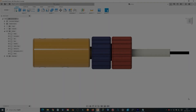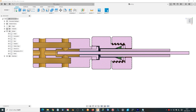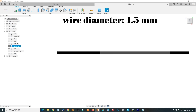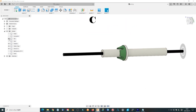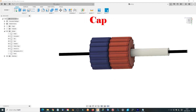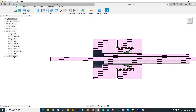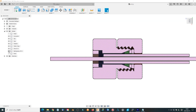The design idea and concept is the same as I described nine months ago. Use a flexible stainless steel wire to transfer the torque from the motor to the output head. Use a Teflon tube to fix the stainless steel wire. The Teflon tube is fixed by a 3D printed connector. A ball bearing is connected to the connector that keeps the stainless steel wire transferring the torque freely.